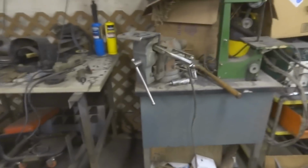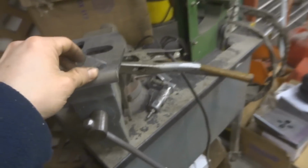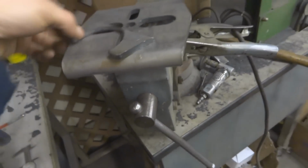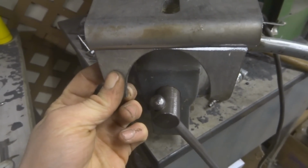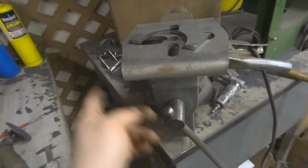Basically how I did that was I just took this, clamped it in the vise, cut out the section that needed to be cut out, beveled the edges on this and then on this. Then I'm gonna take it out of the vise, set it over here, and I'll use a square, and I'll make sure this is square and centered in the bracket, because you notice that when you section it, it's gonna get narrower, right? Just because it was on an angle before, but I'll blend it all in afterwards.